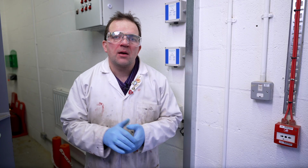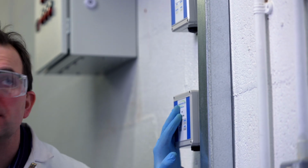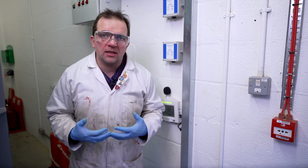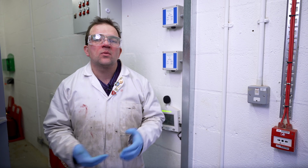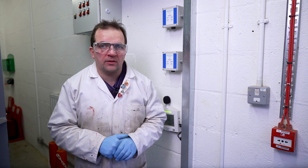Here at our facility, because we focus primarily on hybrid propellant rocket engines, we've decided to install oxygen depletion and enrichment sensors, carbon monoxide sensors, seeing that these are roughly about head height. And then down here we have a flammable gases sensor. Flammable gases are heavier and more dense than air, so they tend to sink down, and that's why you want a sensor down low, whilst the carbon monoxide and oxygen sensors will mix in with the environment around, and so you want to be able to know what those levels are specifically in and around the areas that most people will work and operate at.